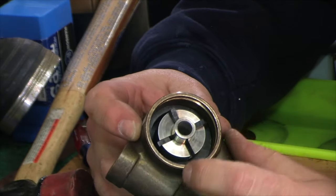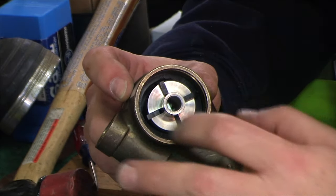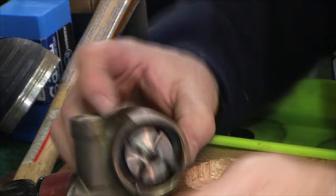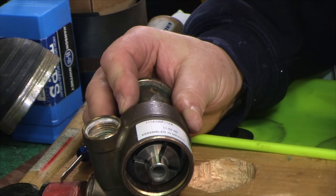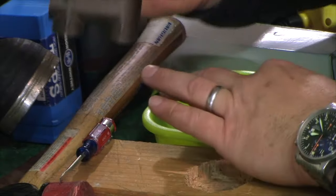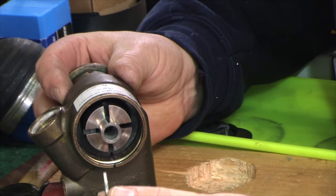The parts are all stainless, and these carbon vanes are going to fall out. One of the most important ones that will also fall out is the long alignment pin. Another one is what I'll call half-crescent pins — these little pins are critical for how you put them back in. I'll show a picture of them and how they go back together.